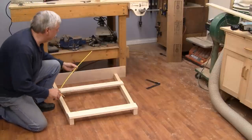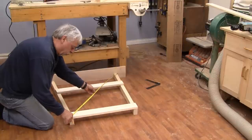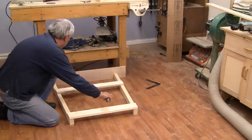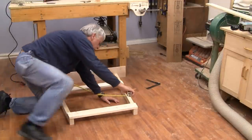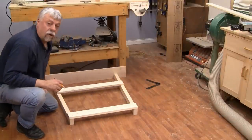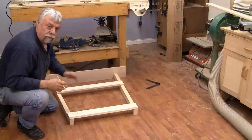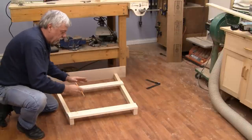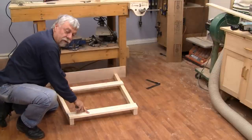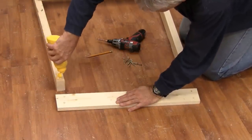The other thing you can do to check squareness is to measure corner to corner — even though it's not a square shape it should still line up. That's 45... yeah, that's perfect. This side is equal to that side, so if it was off you'd move it one way or the other to make these line up. So all I have to do now is glue and screw, since I've already countersunk these. I just made a light mark so I can see where to put the glue.